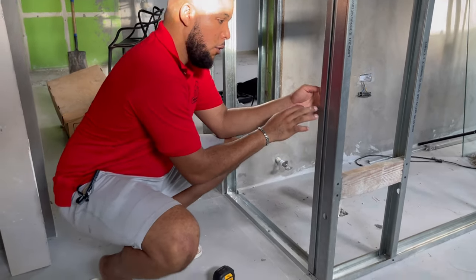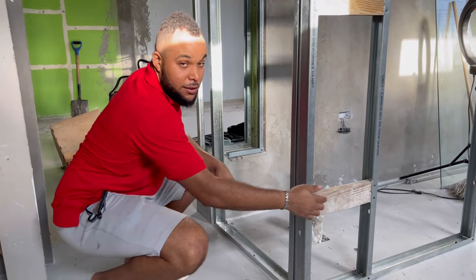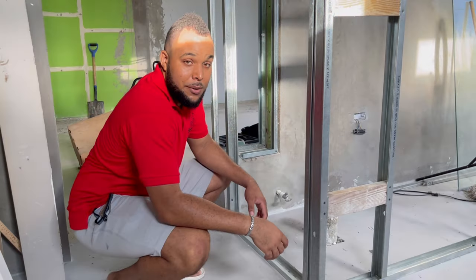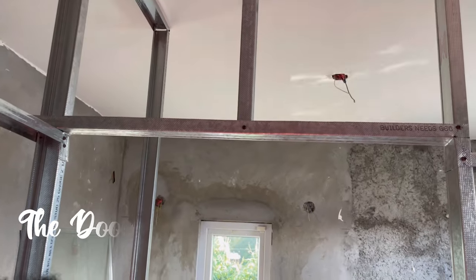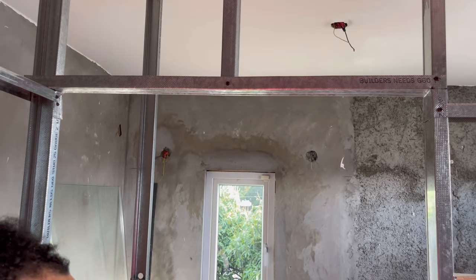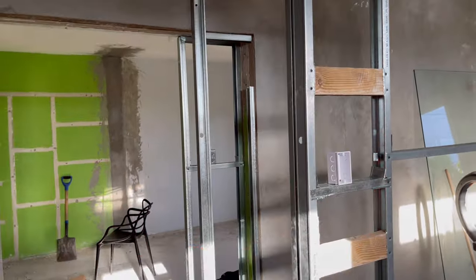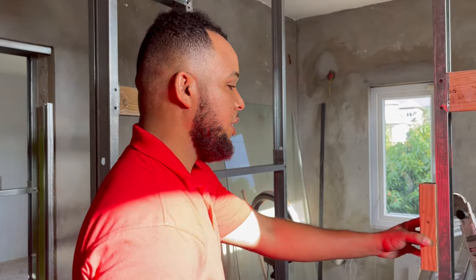You wouldn't want to screw this to the same part. The corner itself becomes the blocking. Because we did use the 2x4 here again, we are going to have this as a door jamb. The door is going to be 30 inches, but you have to accommodate for the jamb itself, which we are going to be using 2x4 lumber for. You measure exactly an inch and a half, and you want to put the inch and a half on both sides. So this width is actually 33 inches to accommodate the 30-inch door.